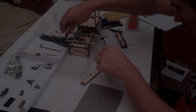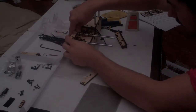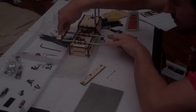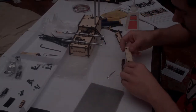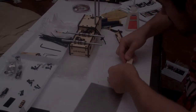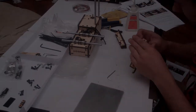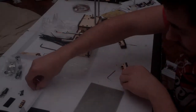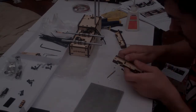The reason that guy's going to hang low is because when we mount him on this side, it actually has to come in and touch this end stop. And we don't want to risk it missing the end stop because that will mean your printer will break. With that done, we then mount this guy, and secure it using two M3 by 16s with nuts.